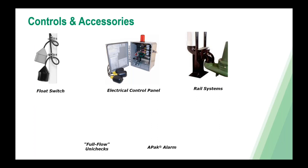The pump assembly can be easily lowered into position without disturbing the piping by the use of the Z-rail disconnect system here to assist in the removal of the pumps out of a concrete, fiberglass, or steel pit. Definitely heavy units would be better suited for this as well.